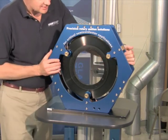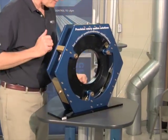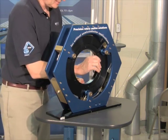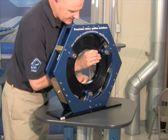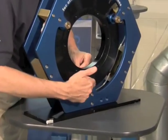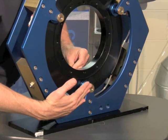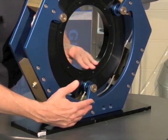The bearings are stiffer than the structure. You'll see that when we turn the air pressure off, the rotor locks in place. The reason the rotor locks in place is that these tangs are preloaded out, so there's less than zero clearance. The bearings are stiffer than the structure — they bend the tang out and create their own clearance and air gap. Just like that.